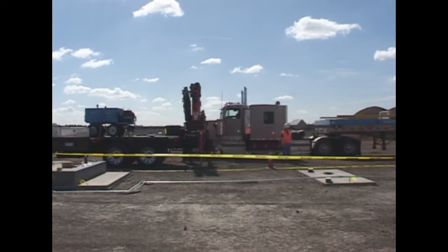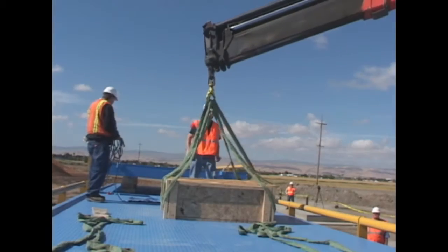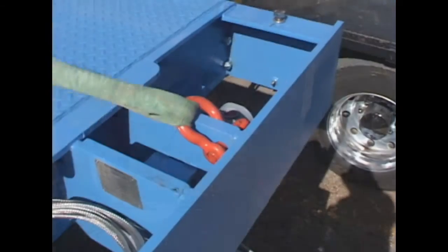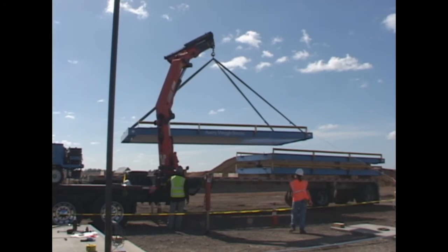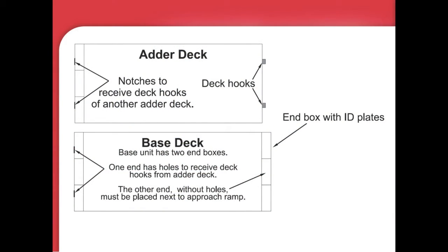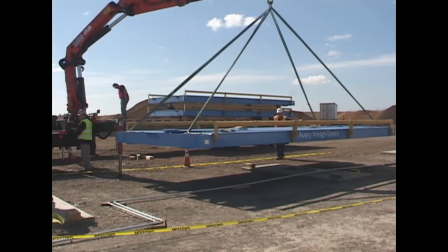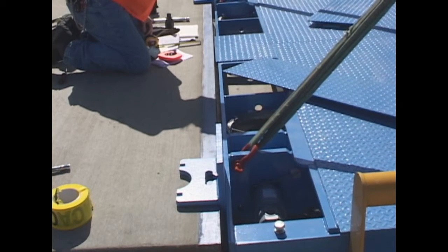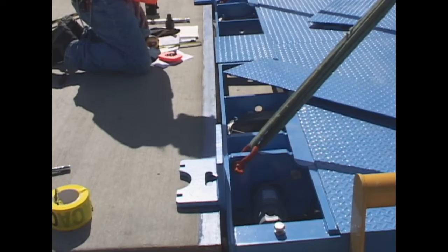Place the crane and truck scale in position for a safe, efficient lift. Place the equipment box close by but out of the way, and using the proper hardware and lift equipment, lift the first module from the truck. The first module must be the base deck — this module always has two end boxes. The end of the module without notches to receive deck hooks must go against the approach ramp. A base plate assembly or a wedge makes a convenient spacer as the deck is moved into place.